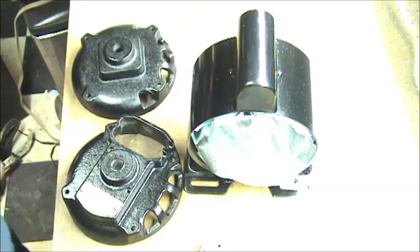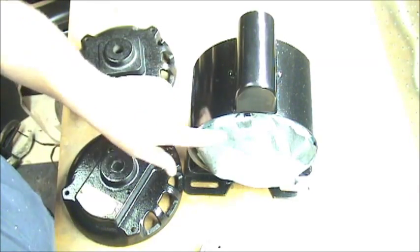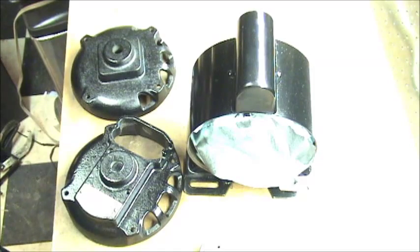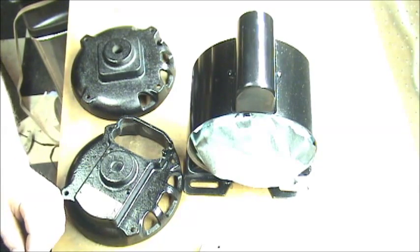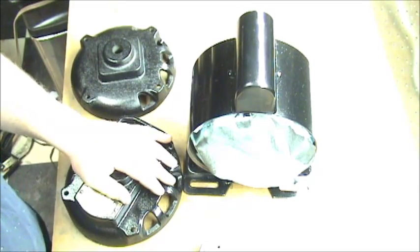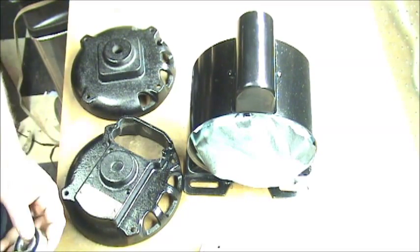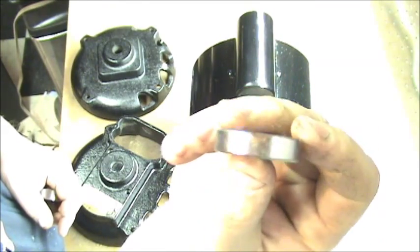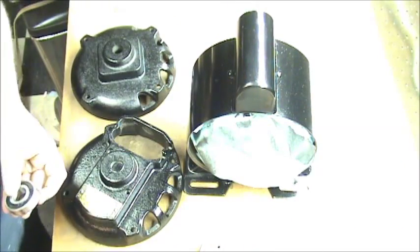Quick update — we're back to the motor. I finally got those bearings in. As you can see, everything's been painted. All I did was mask and paint it with some gloss black spray paint, worked out pretty good. The reason it took so long to get the bearings is they're felt shielded bearings, which are getting pretty hard to find. A lot of older motors and equipment use them, and you'll also find them in cars like power steering pumps. Older GM vehicles used them for a fact.